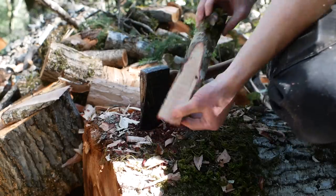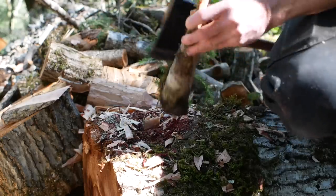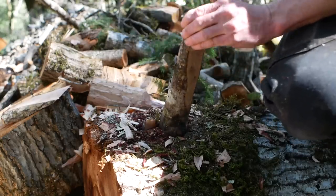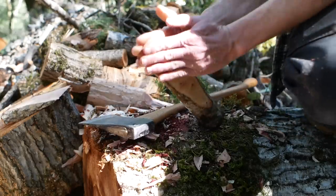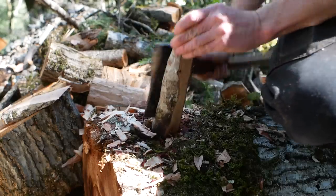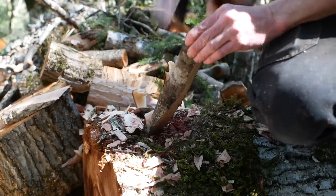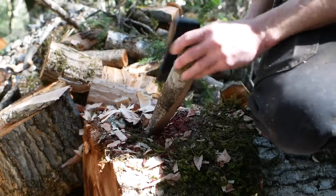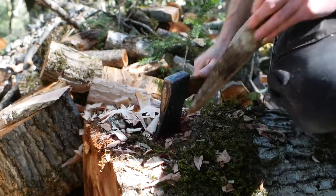This could still be a little bit too fat, so sometimes you need to come in and thin the whole thing down and make that angle just a little bit more acute than it might naturally be — especially on a small stick like this. On a bigger stick it could be more of a problem. You'll also know if your wedges keep squirting back out of the splits — you probably need to make them a little bit more acute.